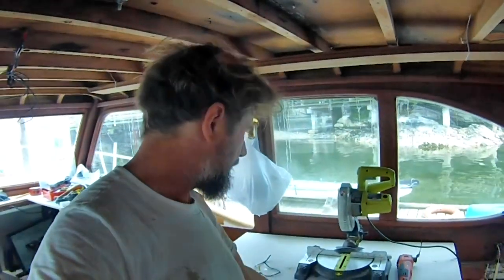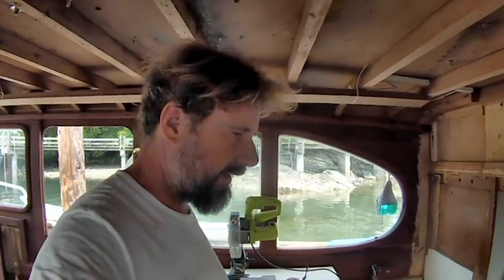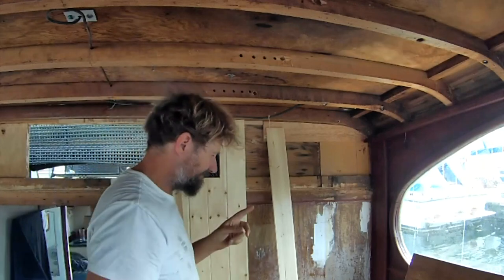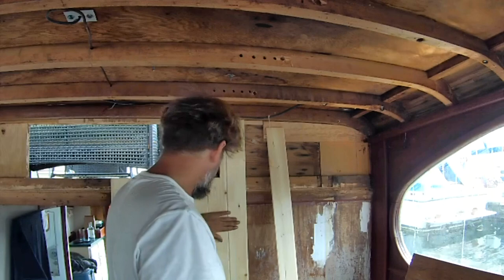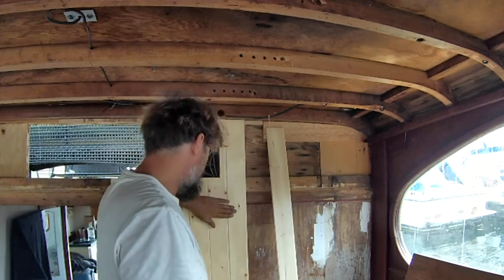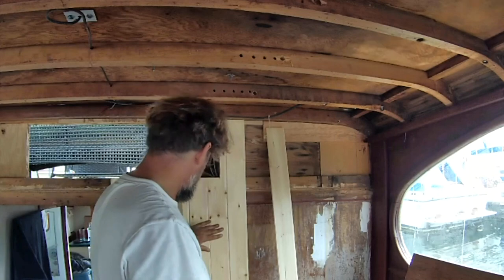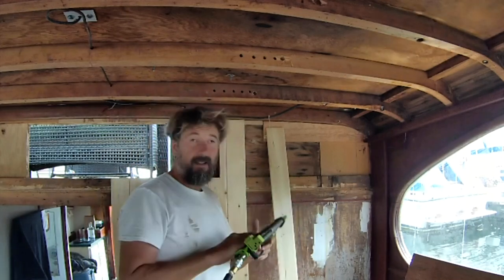Okay, let me finish trimming this off. I've set up my new bench, solid as anything, with the chop saw ready to cut up some of this V-joint. Let's get some of it on. This is going pretty well, with the exception that I don't have enough wood, but it's cheap and it's available locally. The quality was not great, but as I get some filler on here I can fill the worst of the knotholes. I don't want it to look plastic-smooth — I just want a nice wood texture.